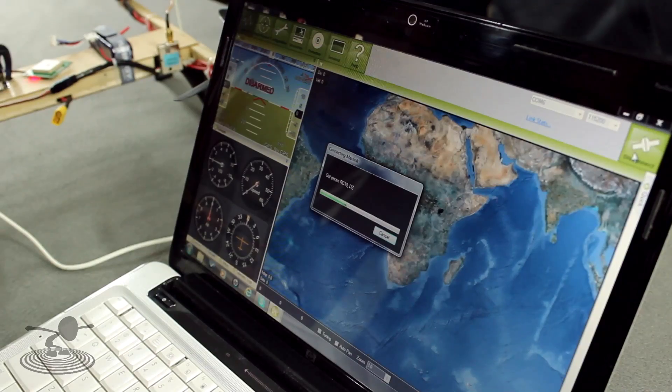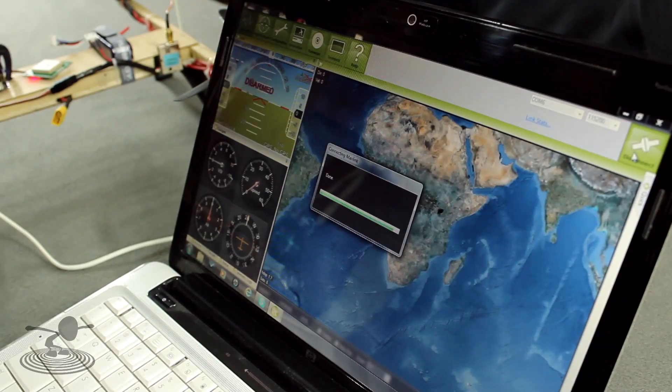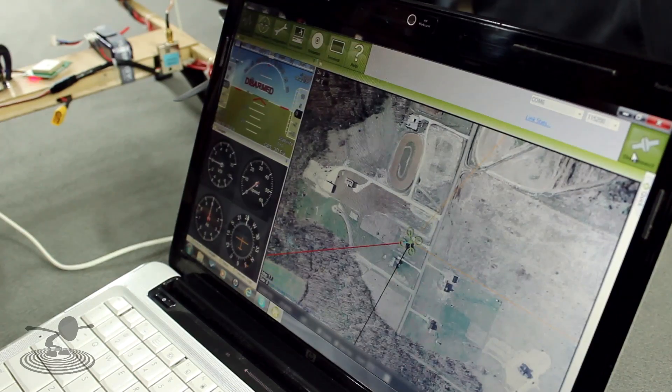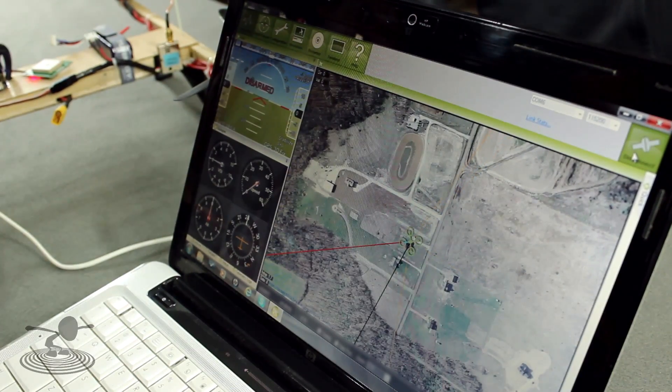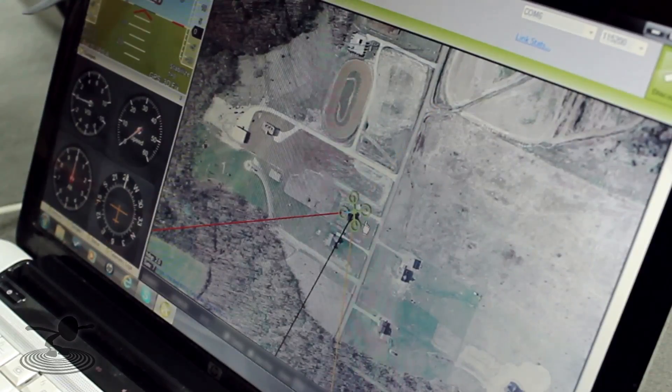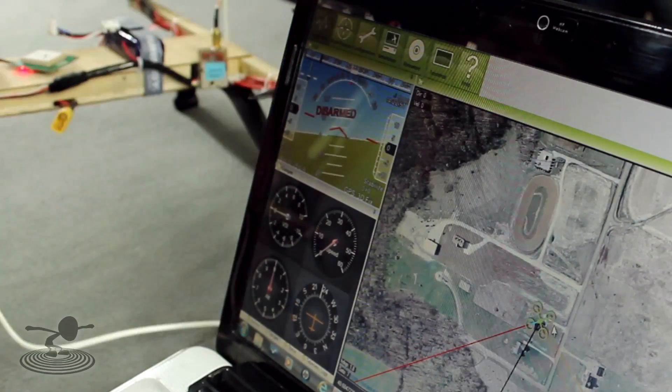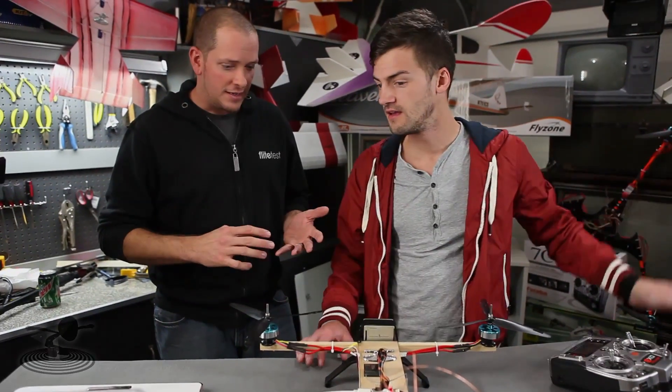What we did is we taped our USB to the main board. It's finding us right now — just getting the parameters. Look at that — that's Chad Capper's house, there's his dirt track. You can select your map that you want. It's freakishly accurate. And those satellite lines going in there — now what if I pick it up? You get an artificial horizon. Isn't that cool? The neat thing about ArduPilot is you can add tons of different sensors: sonar sensors, optical flow sensors — all that you can add onto this. So you can constantly build it up, make it better, more integrated, more autonomous as you go. It's fully expandable.